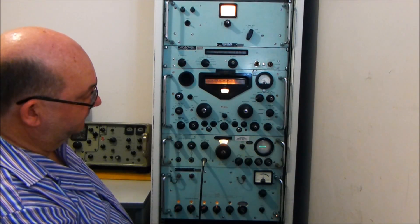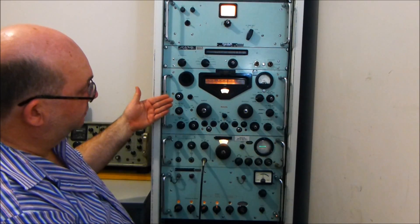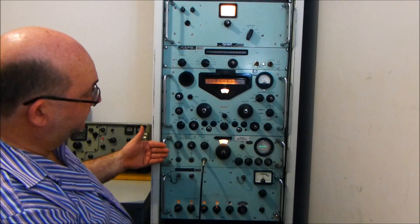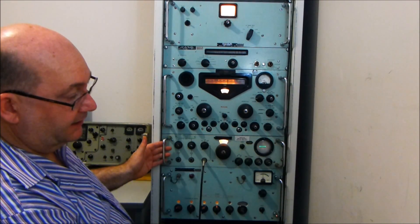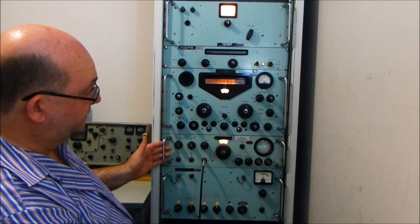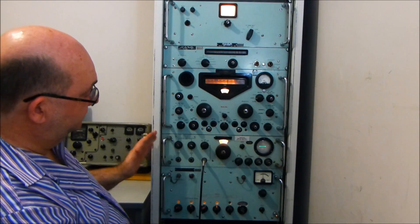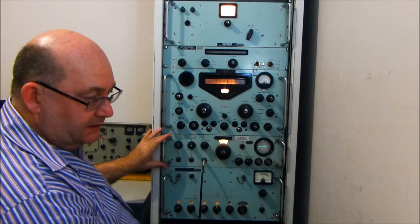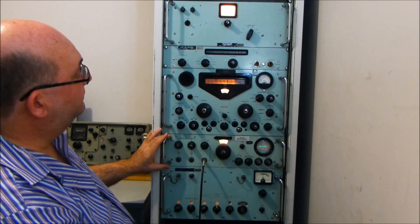And of course with the stability of the synthesizer you've got the best of high dynamic range receivers. We've got a good noise floor, reasonably good filters, and frequency stability. Bear in mind that the frequency filters inside this particular unit are actually just an LC form — there are no ceramic or crystal filters. It's just an LC filter of probably about 10 or 12 stages, so it is a very high-Q narrow band filter.